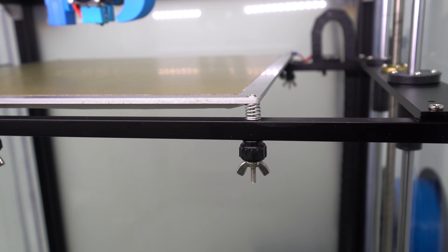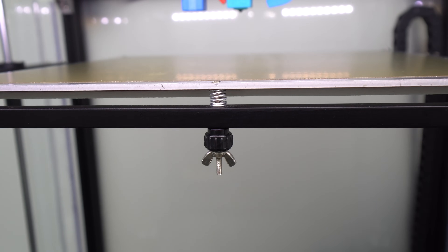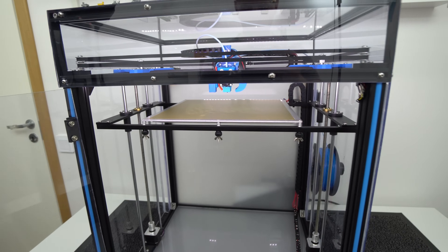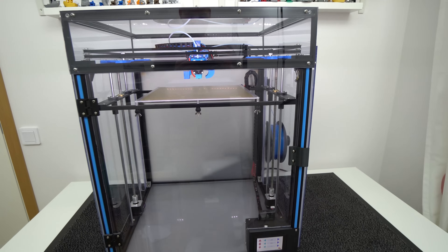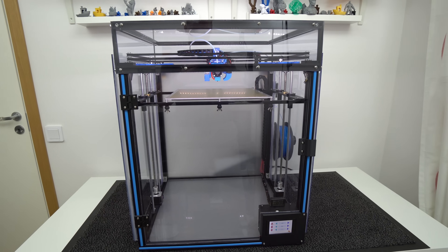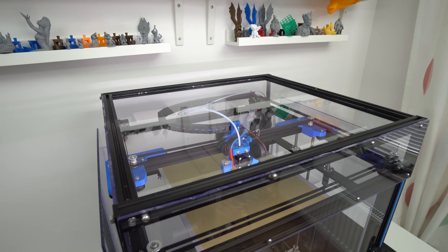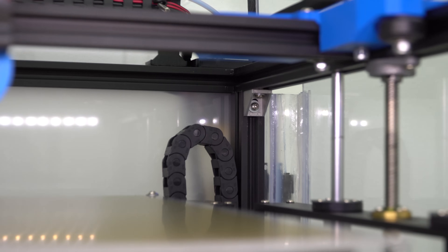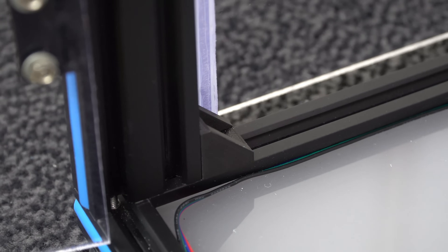On the leveling adjusting nuts I added extra butterfly nuts and screwed them tightly against each other to make sure they hold their position. This enclosure is very useful not only for printing ABS, which loves to warp and crack, but also for PETG and other filaments, as it keeps a stable temperature and protects the printer from dust. To make the frame even stronger I installed metal corner brackets — some made from metal and some printed — making the frame much more strong and stable than before.